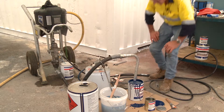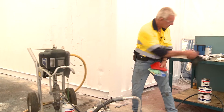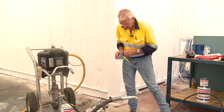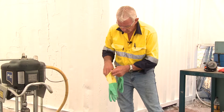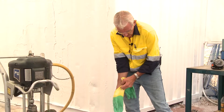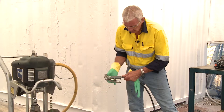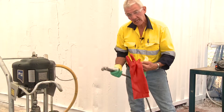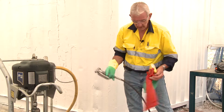We wear gloves. There are three types you can use: the rubber-coated gloves, solvent-resistant gloves, and there's nothing wrong with a pair of old washing-up gloves. These gloves will resist a small amount of solvent, but more importantly I can feel the gun when depressing the trigger, and I can feel how tight I'm putting the tip housing on, and I can feel the safety much better than with a big glove. Remember though — once the system is pressurised, it can impregnate any glove and inject you.